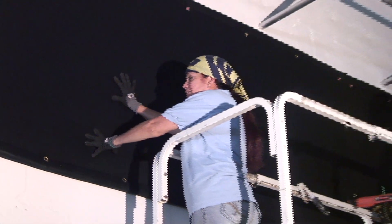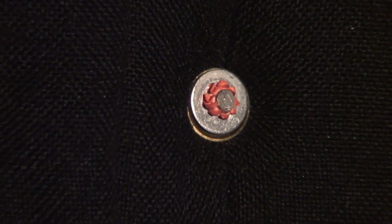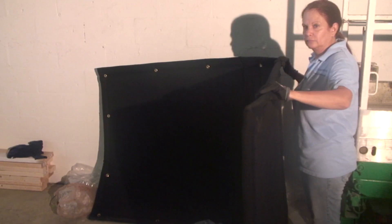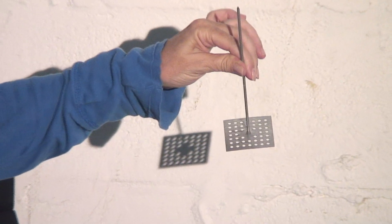This blanket may be wall mounted, ceiling mounted, or hung in a curtain track system. The option to install Acoustic Quilt over drywall should be with 1-inch or 2-inch nails at 24-inch OC. To install this material over concrete or metal ceiling, HILTI pins with washers should be used.